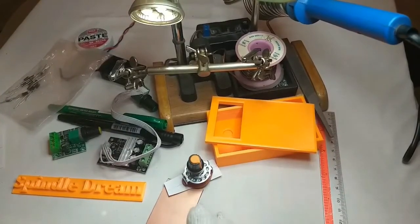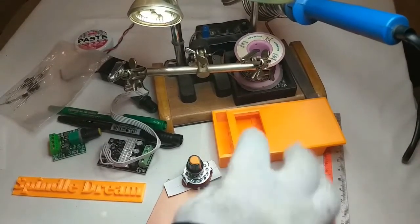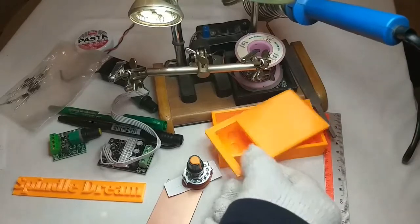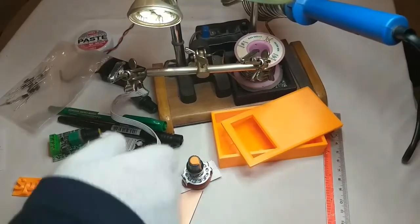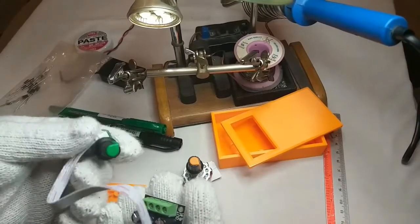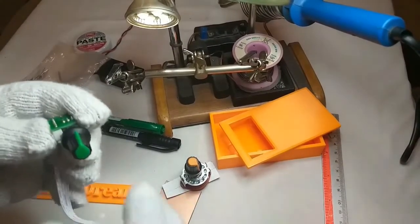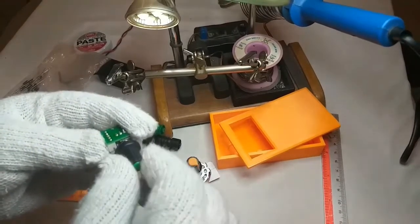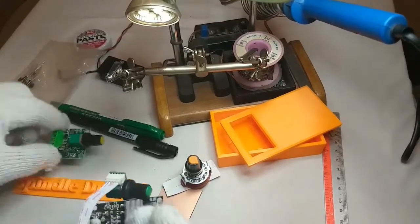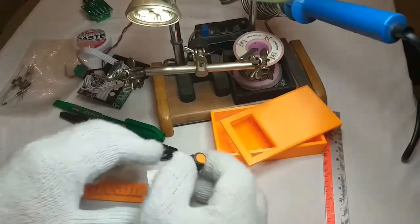Okay, I try to do the circuit. What we have here, I got a 3D printed box, or any box, you know, you can do the circuit. This is just the enclosure for the circuit itself. And this circuit is not working for me because of the potentiometer. It's not giving me the exact temperature I need. You need to adjust it like this and it might take time, might bring it to zero, which I don't like. And also that one is getting from 0 to 12. So this is not needed. I use that one.